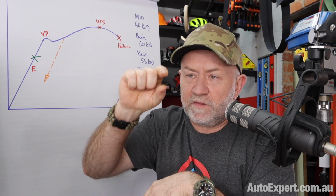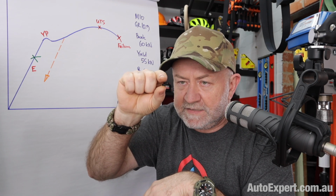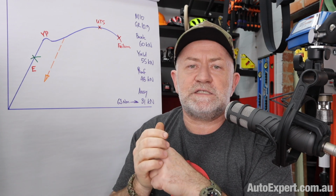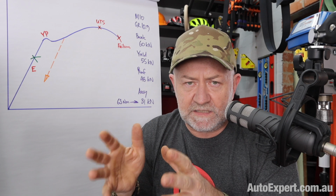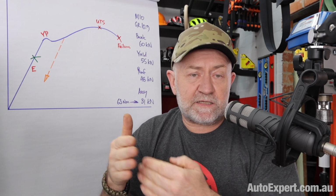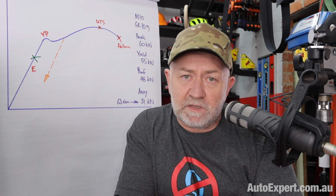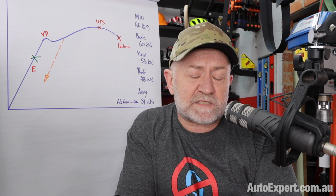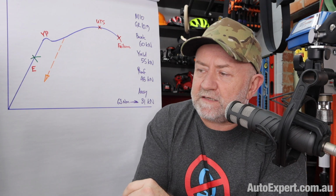Like, you started with this much gap between the nut and the washer or something, and then you compress those dimples and it went down to this much. You stick a feeler gauge in there, and it's a very accurate measurement of the stretch in the system, right, because of the compression of the washer. And that's fine, except you don't always have physical access to the side for a feeler gauge, and you generally don't have that in automotive terms around things like cylinder head bolts. So not very practical in that case.